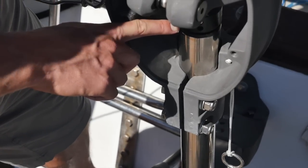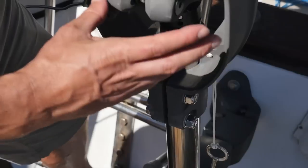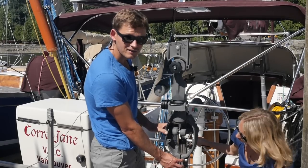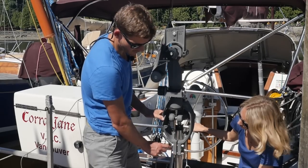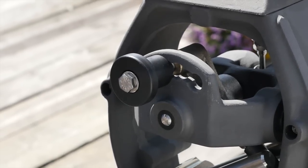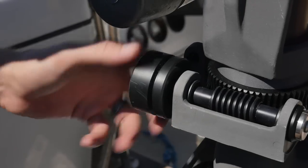In some situations you'll find it's a bit tight getting it on. There's a threaded bolt hole on this side — you can thread a 10mm bolt into this hole and turn it a quarter turn at a time. Don't overturn it because you could risk damaging the casting, and make sure these bolts are loose before you crank it down or you could do real damage. It's also easier if you can turn the worm gear assembly so the lead counterweights are on the front side, so the weight is centered.